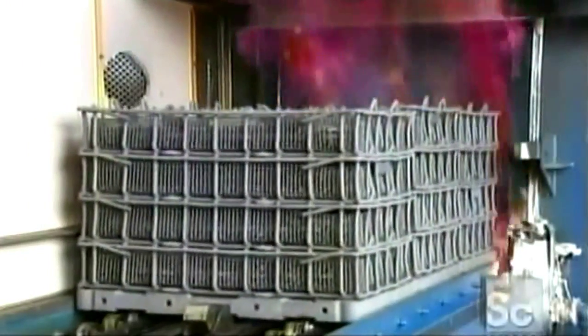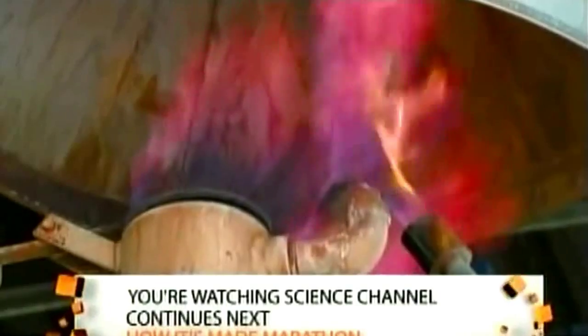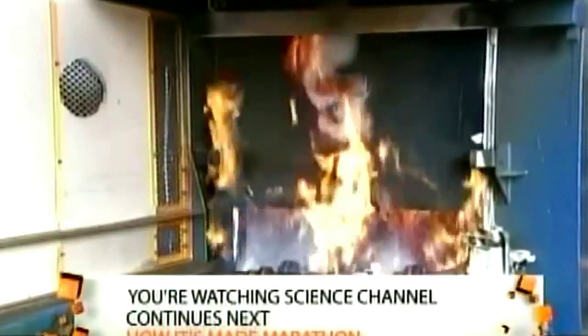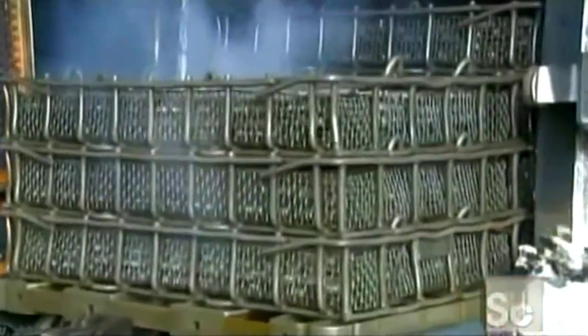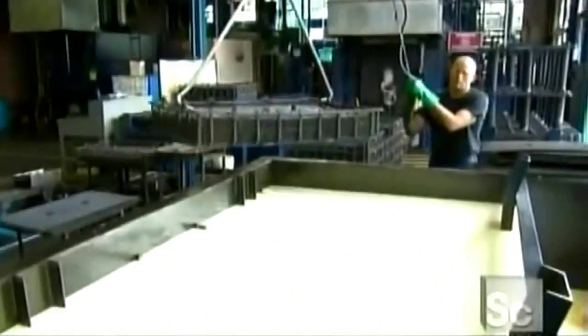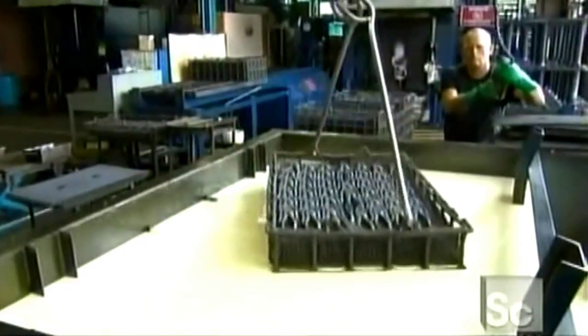The cutting pliers go into a gas oven for another 2 hours of heat treating, a process called mar tempering. When they come out, they cool in an oil solution, rather than the salt solution that cools the gripping pliers. Steel is a finicky material, so it's critical to manage the heat treating process meticulously. Otherwise, the metal will be substandard.